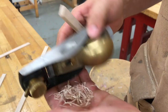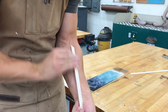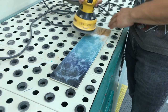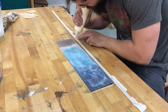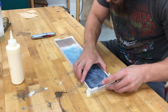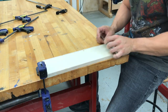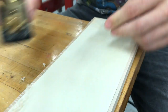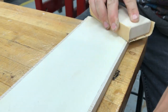It's not hard if you take your time, build a proper sled, and make sure your blade is at 45 degrees — but pay attention to detail, because this piece doesn't have many details, so the ones it has have to be right. I'm a big fan of using a tape clamp for small projects like this. It's a perfectly wonderful clamp as long as it's nice and tight. Once dry, I took it to the workbench, cleaned up the bottom with a card scraper and hand plane, sanded it flush, and it cleaned up nicely.